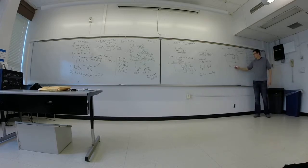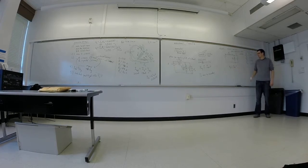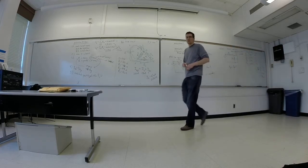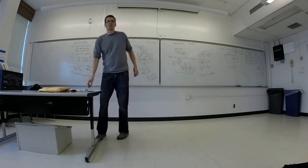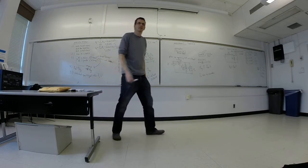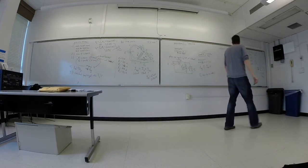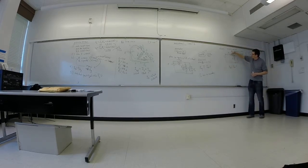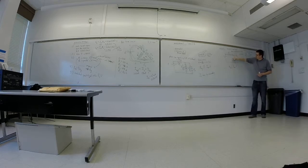So the total current is going to go up. So I am affecting it. This is one of those occasions where it's really useful to be able to think of series circuits, as I was talking about at the beginning of next time. I have R1 in series with R2 before. Now it's in series with the R2 voltmeter combination.